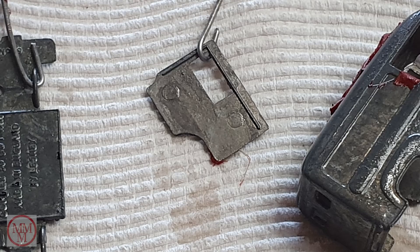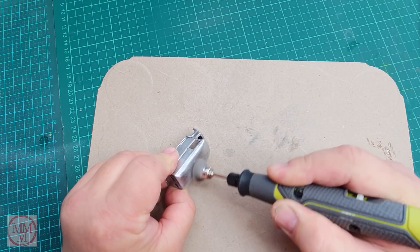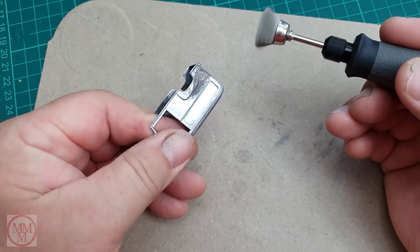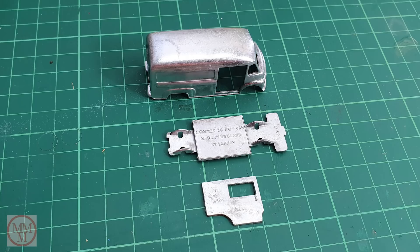I did a good job of removing the paint. After I've washed them off, the metal actually went sort of dark grey, probably as a result of the chemical reaction. There's an example of an area that I've cleaned with the Dremel and the lower area that I haven't — you can see it's very dark grey. So I just run the soft wire brush over at low RPM. A subscriber recommended running the Dremel at a lower RPM to reduce the number of fibres that fly off, and it actually seems to work.